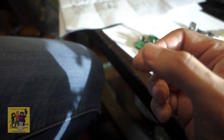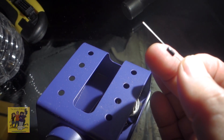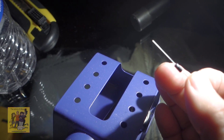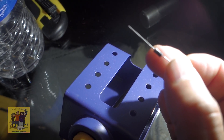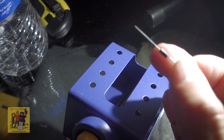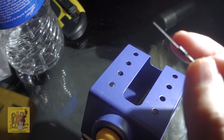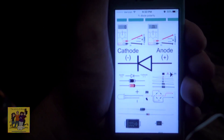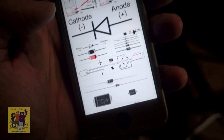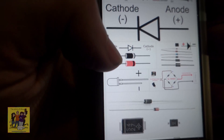It is directional. If you can see that gray stripe on one side, that distinguishes which direction you need to place the diode. Britain is looking that up now. You definitely have to use a magnifying glass to match the number on the instructions or inventory list. That gray stripe is the cathode — basically the negative side. The positive is the anode, which is the opposite side from the stripe.